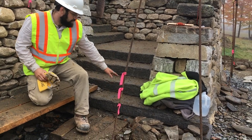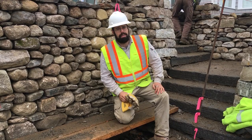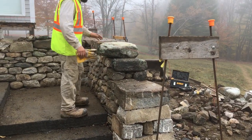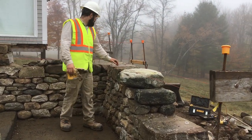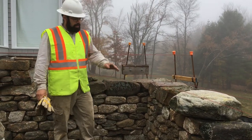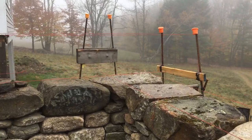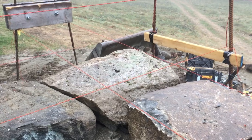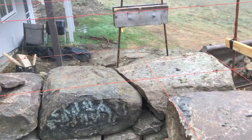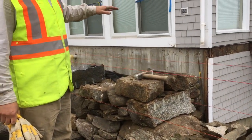These ribbons on this one correspond to these bottom couple of stairs — there's another trick for you to use when you're laying out a complex project with lots of elevations. On the stairs and landing here, this rock is still being set. But again, you can see the frames and the string lines happening. We've got walls of changing heights here, so that's why we see multiple string lines. Some of these lines that are up are just referencing this last little bit of wall that's going to come up another two feet and have a nice cap on it.